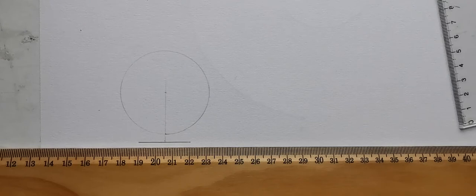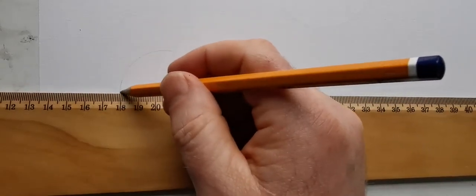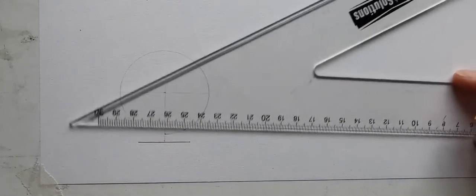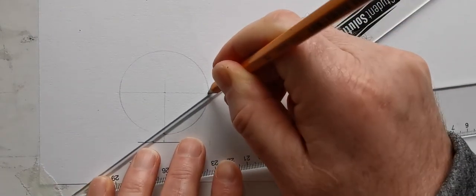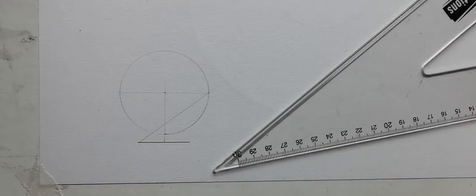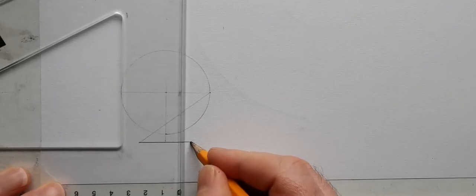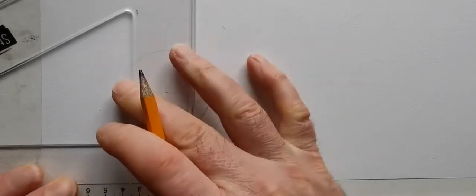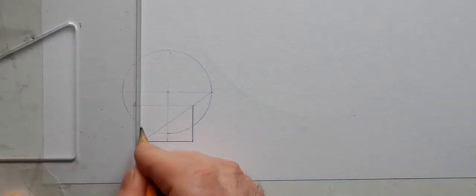And we've got to draw. Now this is the thing, you gotta be careful here. You gotta put a horizontal. We've got to draw a diagonal line from the left corner up to here. I'll put this in a bit heavy so you can see. There's our diagonal, and this right hand side goes up to touch it, so that gives me the height for the verticals here.